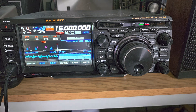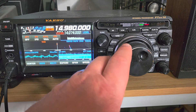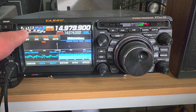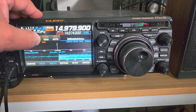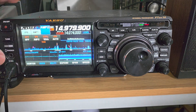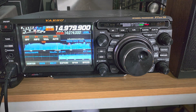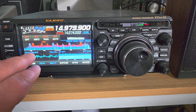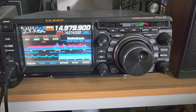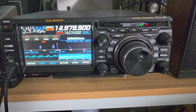Most of the time I actually have the base amplification turned down and I don't add any amplifiers to the signal level — it's not useful. Look, if I remove myself from a signal — I have no signal here, just noise at about S4. Even if I amplify, I would not get any signal. I would just get a lot more noise, now S9 of noise. There's also some weird ticking from a device today. I only amplified the noise. So resist the temptation of buying any amplification of any kind for shortwave.